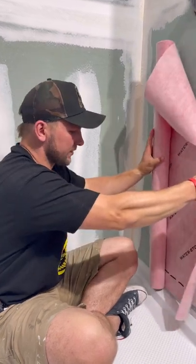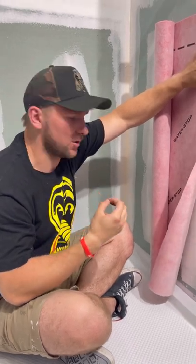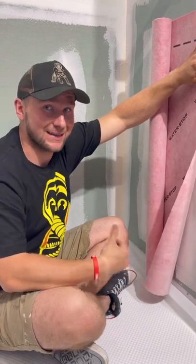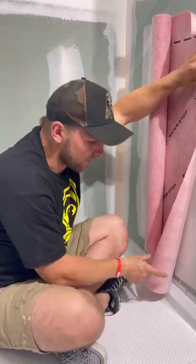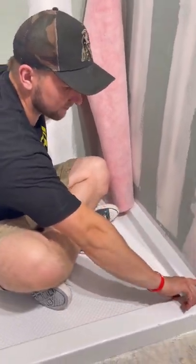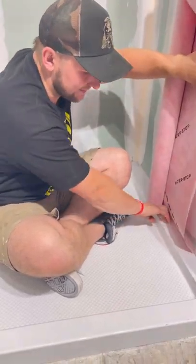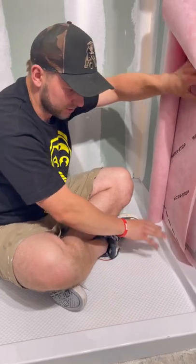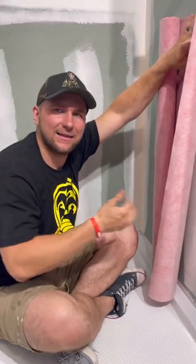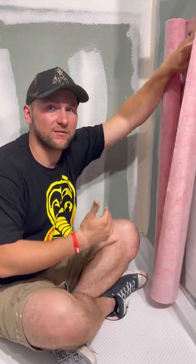This right here is Guru Water Stop membrane. It's a hundred percent waterproof and extremely durable. In Europe they use this to line their pools and roof decks — they literally use it as a pool liner. At the bottom we're going to put a big fat bead of sealant down there, then this runs down over it, you press it in, and that creates a hundred percent sealed shower situation. Once we put this on, we can start tiling immediately — we don't have to wait for anything to cure or dry, which is a huge benefit.